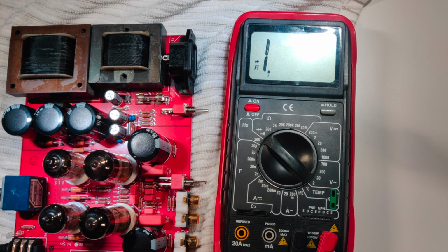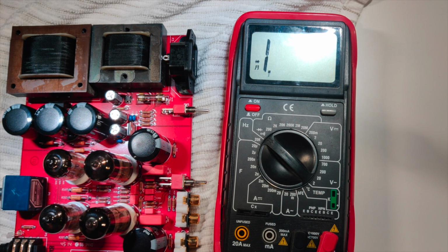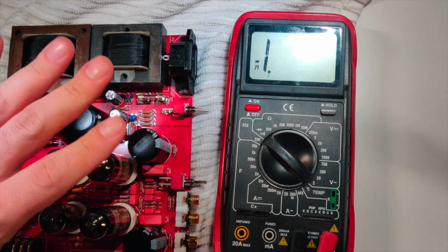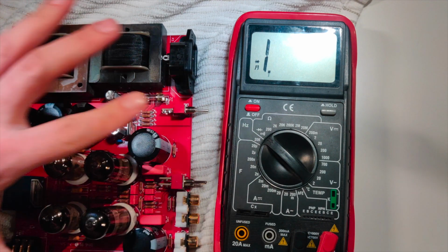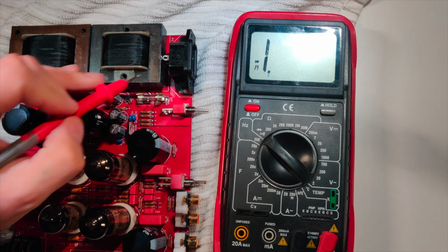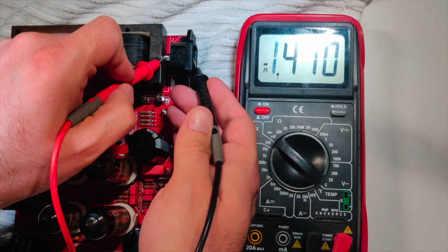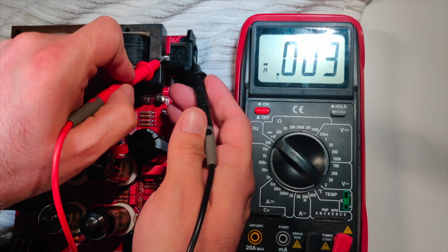All right, everyone. So I may have just stumbled across the cause of this, and I did it last night as I was falling asleep, as these problems commonly end up being resolved. It didn't occur to me to consider any sort of thermomechanical stresses on the board, and I completely overlooked this entire time. But look right here. This here is a ground pin. If I touch the ground pin right there, like that is the ground pin.